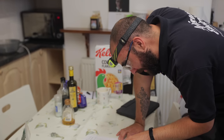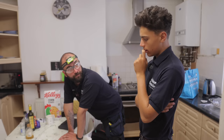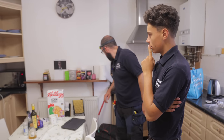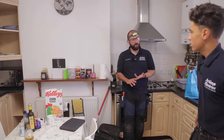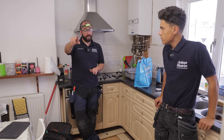We'll keep looking. So, confirmation of earthing conductor size. Do you know what size the earthing conductor should be? Is it the same as in normal circuits where it should be 1.0? So what do we install when we replace a consumer unit? We put in 25 mil tails, and do you know what size earth conductor we stick in? 16, isn't it? 16 mil, yeah. Right. So at the minute, that's a 6 mil.